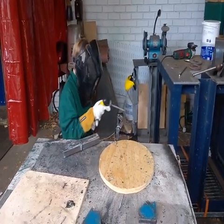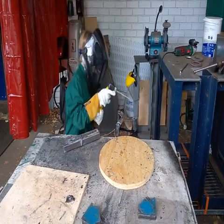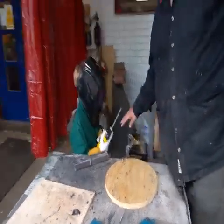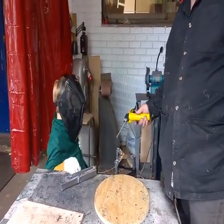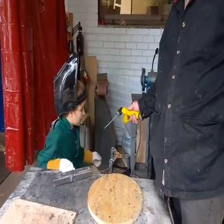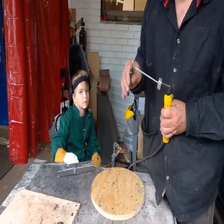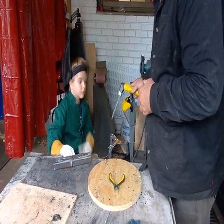Sparkle it on the top because we can grind that up later, because remember the flux around the tip is all knackered. So no, don't, not banging it, do it like this. Can you see on the tip, lift your helmet? Can you see how there's wire sticking out with no flux? So I'm going to cut some of that off. Just makes it worse again, yeah?